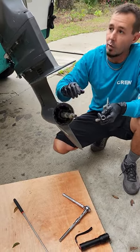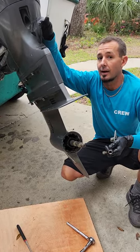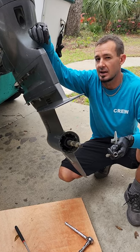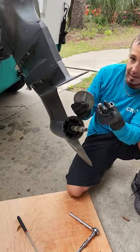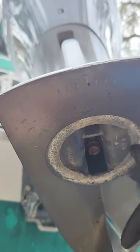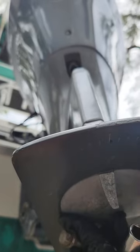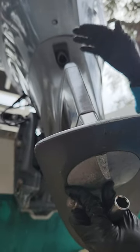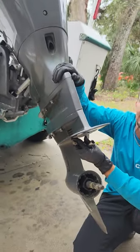I went back from the top hole here, tightened it all the way back up again, then loosened it back up. At that point, just one little quarter turn, then I tapped it with a hammer very lightly. What that did — come down here — was break up the seal that was forming from corrosion, which had stuck this thing on really tight where we couldn't tap it left or right. Tightening it and then loosening it back up and tapping from the top seemed to do the trick for us, and I hope it works for you guys.